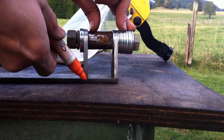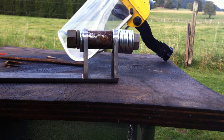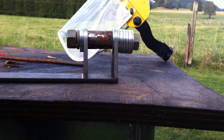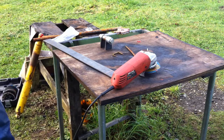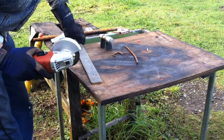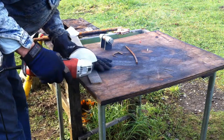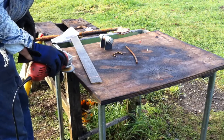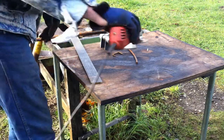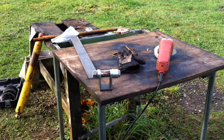I put the fitting brackets up on the piece of flat bar and drew a line on the outside of where the brackets met, making sure that the outside portion where the nut of the bolt was flush with the end of the flat bar. Then I took the bracket off and went ahead and cut on the inside of the line that I had made.